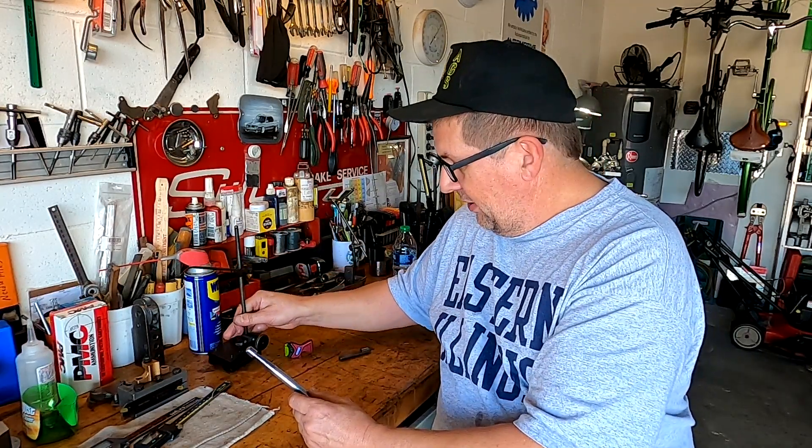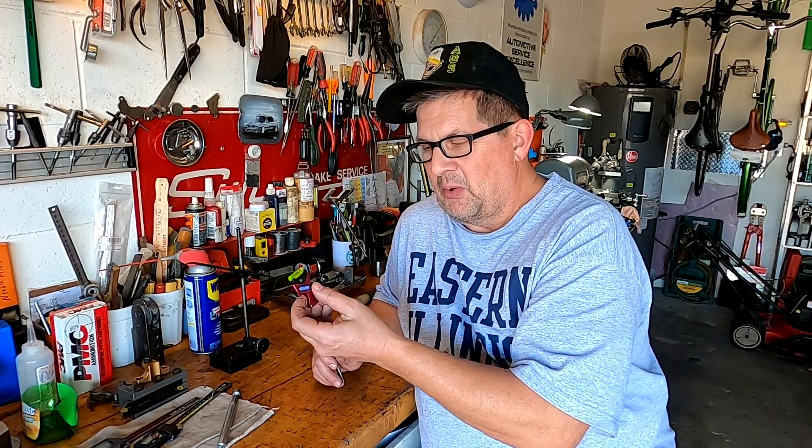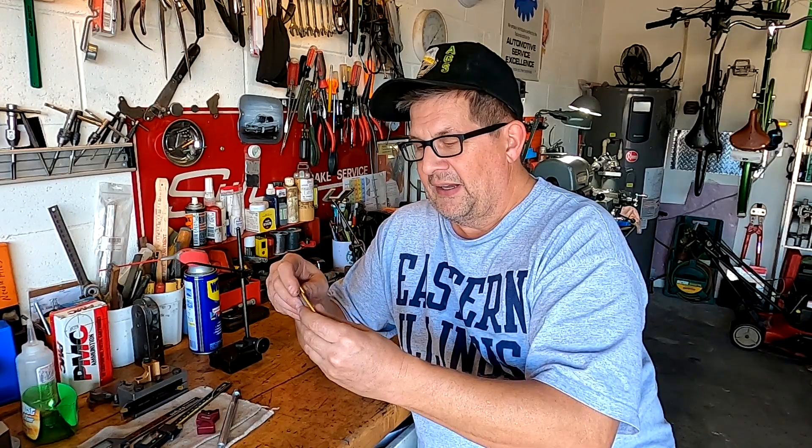It basically comes down to picking my poison now. I'll have to watch out for chips on that magnet, but that's no big deal — I'm always watching for chips anyway. I've always got the level to fall back on, though I do tend to misplace it and it does go out of adjustment — I'm always having to reset it. The ground pin has always been my favorite; I have one for the small chuck and one for the large chuck, but I usually end up having to walk back and forth to the toolbox to find it. Having this on the lathe bed right handy is going to make a lot of difference. I hope you've learned something new — it always helps to experiment and try new things. As always, from Florida, Don out.